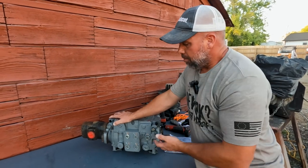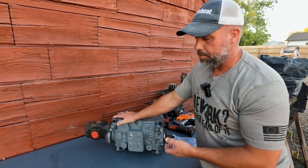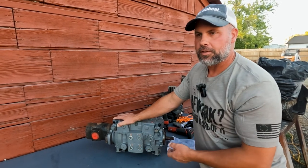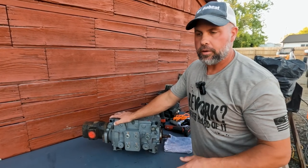I personally like to pull the whole engine out because it's just too much trouble to work on this thing inside the machine. You're going to have to pull it out if you're going to split your pump anyways. Don't even bother replacing your swashplate sensor — it could be something in the wiring or anything else. You can adjust the swashplate sensors, but more than likely it is going to be that plastic bushing inside the pump if you've exhausted all other options.